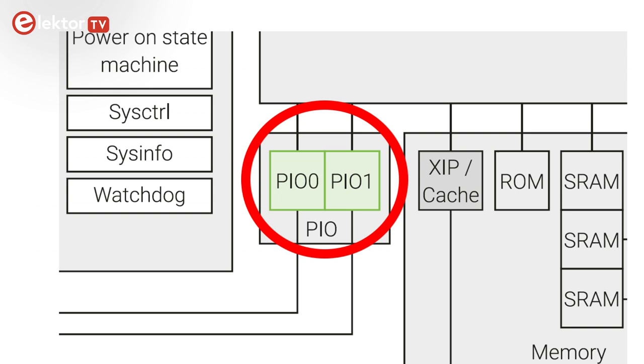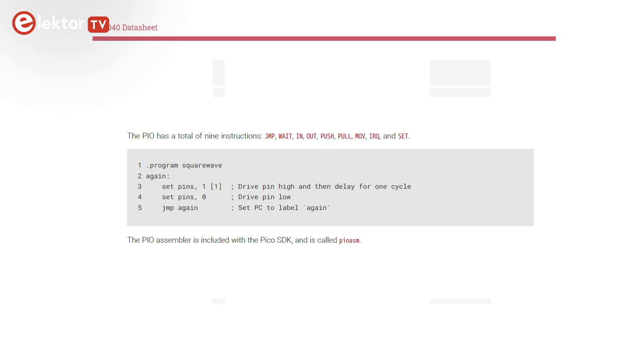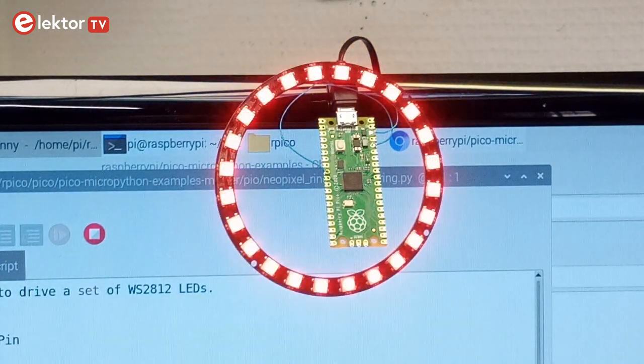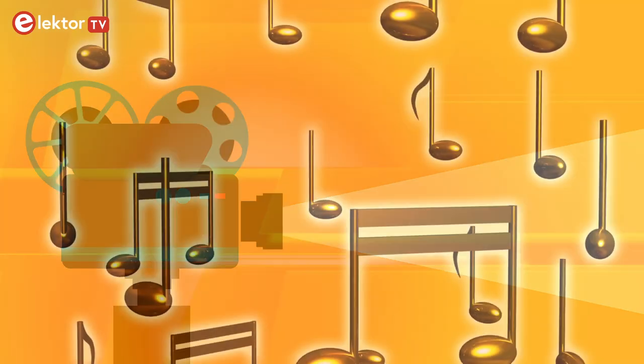It is true that the RP2040 is very cheap. Besides being cheap, the RP2040 also features programmable IO blocks — special flexible logic inside the chip that can execute tiny programs independent of the two cores. This makes them suitable for generating signals needed to interface with hardware like displays and audio codecs. So when you dedicate one core to PIO control, you end up with a dedicated function for a special task, and the other core can run the main application. The fact that the two cores share all the memory also becomes interesting: one core can fill memory with decoded video or audio frames while the other outputs it as a VGA video stream or an I2S audio stream.